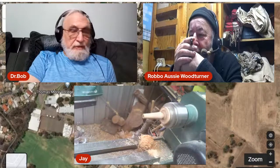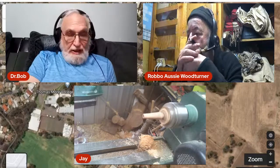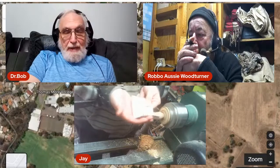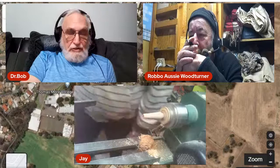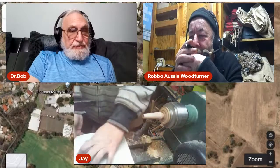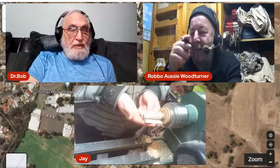People don't seem to do anything about that. And one trick I learned is when I do my lathe bed, I do the top and the inside edge of it. I also make sure that the disc and plate on the bottom of the banjo and tailstock are cleaned off. And then I will actually hone with big diamond cards. Lucky you didn't have a dust extractor there or you'd be chasing it. But I got all that cleaned up today and I'm back to one hand being able to control it.